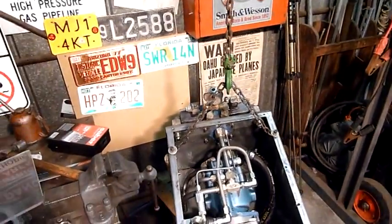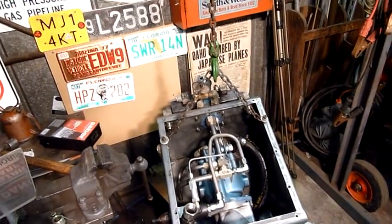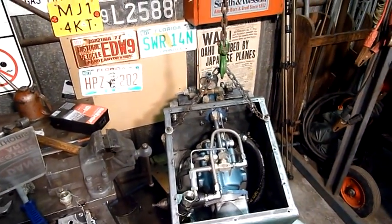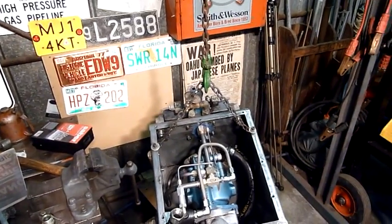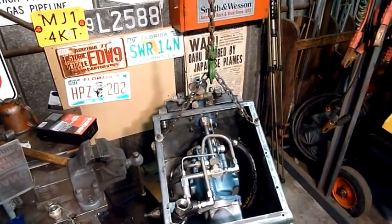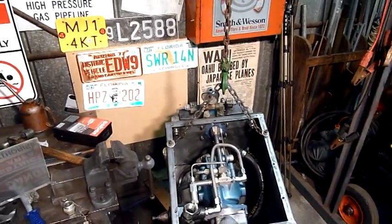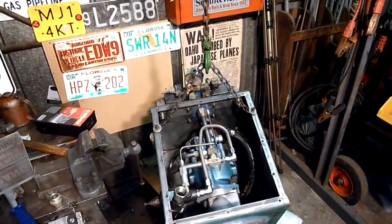I haven't tested the solenoid valve yet, but as pointed out by one of my loyal subscribers, it is an industry standard valve and I can swap it out for a number of different models, including low voltage solenoids, higher flow rate, all sorts of things. So I'll look at replacing that with a higher flow valve with probably 24 volt solenoids and go from there.